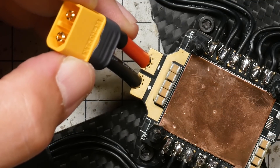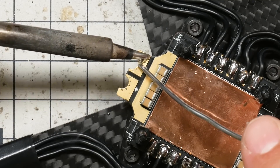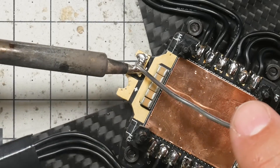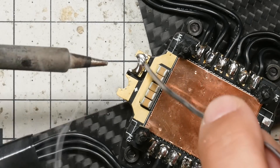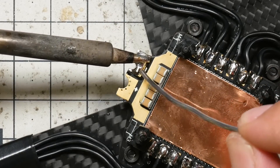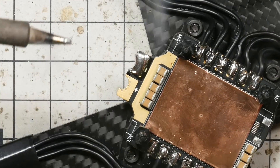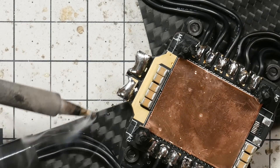Don't make that mistake, or the first time you plug your quad in, your smoke will come out, and all your work will have been for nothing. I'm going to add a little bit of fresh solder here. You can see the solder is not really melting — this ground pad is the hardest one to solder; it takes a lot of heat. If you put your soldering iron up against it, what you want to see is that everything becomes liquid. This is the part where if your technique or your equipment is not up to snuff, you will find out and you will struggle. Don't just bang your head against a wall — stop, back away, let's figure out what's wrong. Ask at QuadCamp Online. Don't just struggle and finally kind of get it to stick, then move on and have your quad fall out of the air.